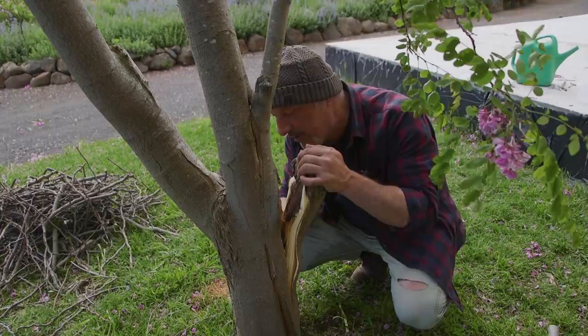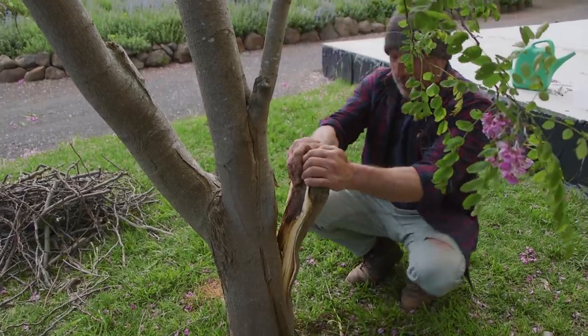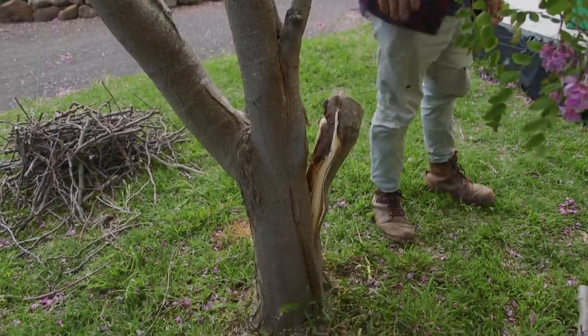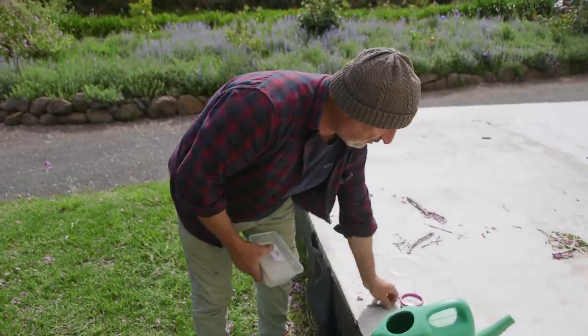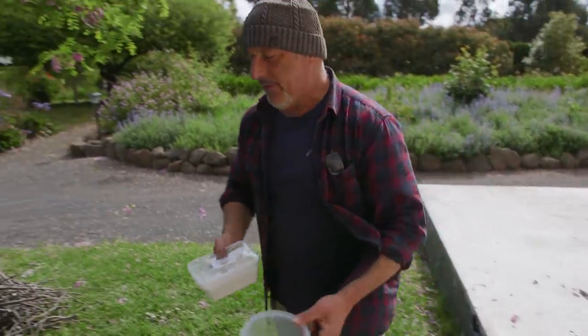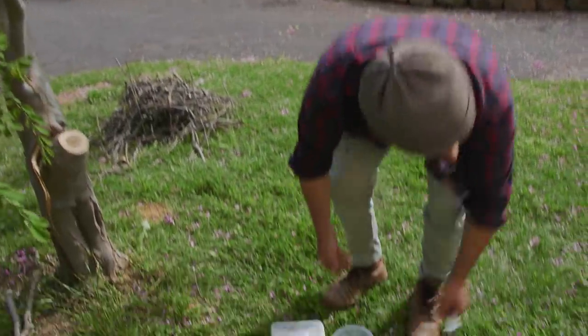But because we've got borers in here, this is going to come off. Now whether I fill it in with mortar, plaster of Paris, or anything else that goes hard is yet to be decided. We need to see what's going on inside because at the end of the day I may not be able to fill it in — just put a whitewash over it to seal it and protect it. I'm going to use our hydrated lime — this is our disease control pack — and make a little mix to turn it into a paint.